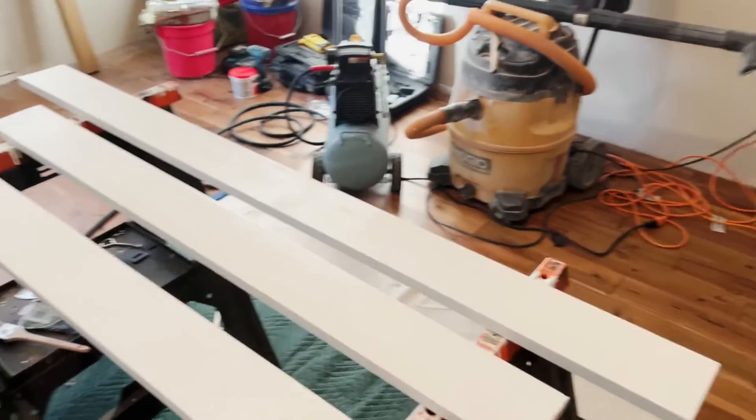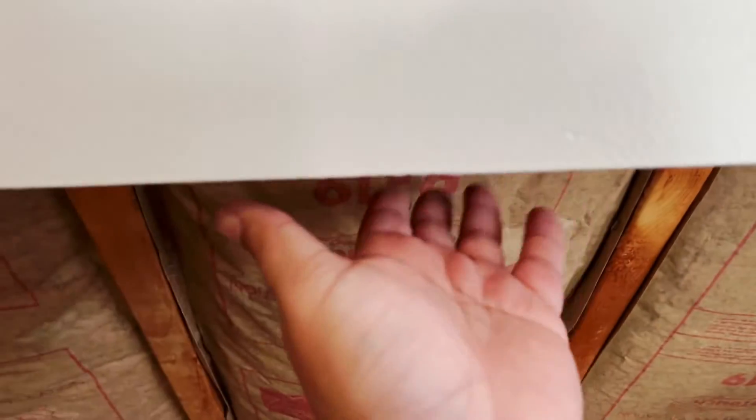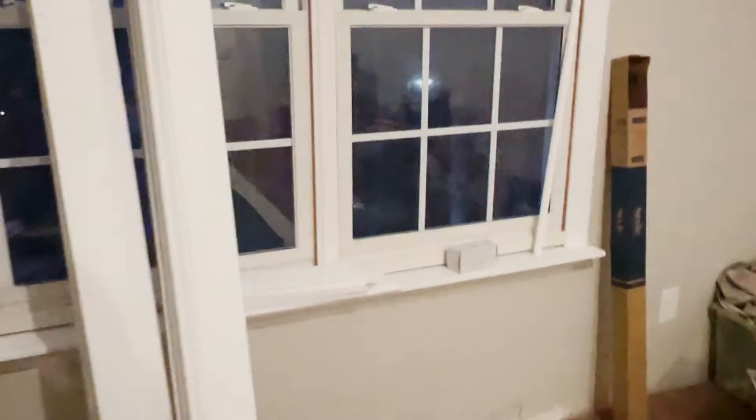As you can see, these are the three pieces going on the inside — one here, one on top, and one on the left side. The inside casing for the opening into the storage area is going in very well. I've got one more piece to put on the top. There's a little chip off the molding there, but you won't see it because the finished molding is going to sit right on top of that. Here's a scrap piece to show what it'll look like — it sits on top and you won't even see it.